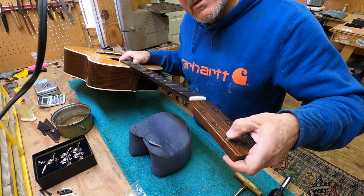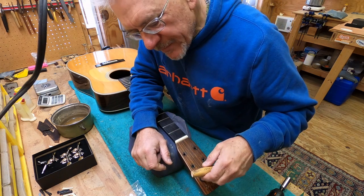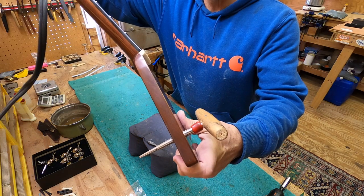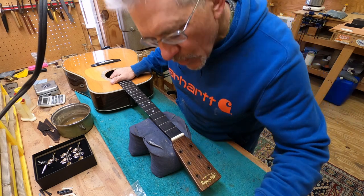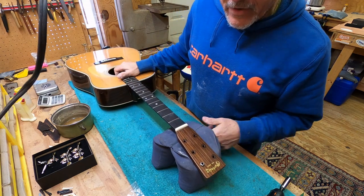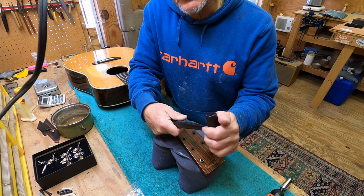It sits in there by hand. This is tapered, so the opening is a little bit larger than it is down inside. I'm going to turn it around and find out how good it fits - use my thumb. It's not quite good enough yet, so we can keep going safely. Now it's just right there on the rim - I'm going to stop. Dust it off, check the fit again. That's pretty good, it's going in about halfway. We're going to tap it in there now.